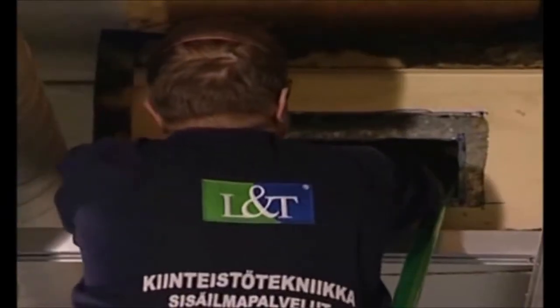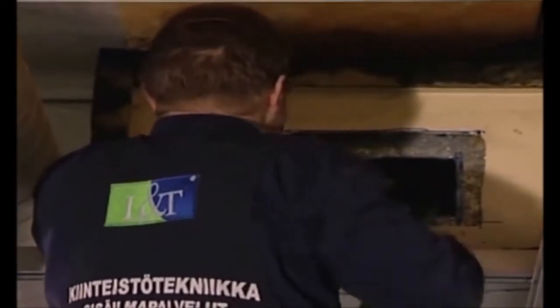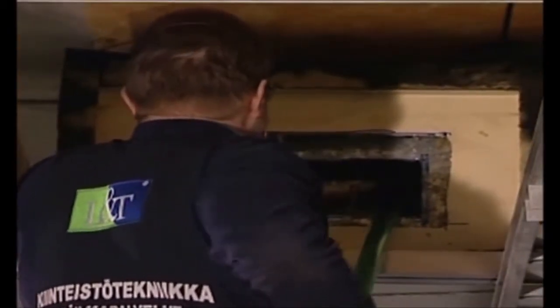In a rectangular duct, the aggressive Tynex brush with bending bristles is more suitable, as it reaches to the corners of the duct also. The Tynex bristle material has a scratching effect because its surface is uneven, best described as sandpaper-like. By choosing the right size of the brush for the rectangular duct, that is typically 20 cm longer bristles than